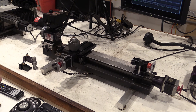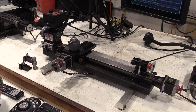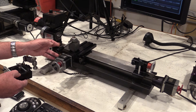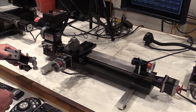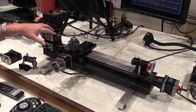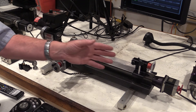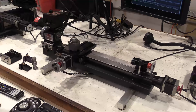Sherline makes what they call riser blocks, and here's one — it's an inch and a half. This comes off, the riser block goes on, then this mounts on top of it, giving you another inch and a half of radius, or three inches of diameter that you can cut. It also has the adjustments on it. Every part you need to raise everything up — tool posts, tailstock, all of it — is supplied as part of this package, so you can work the way Sherline originally intended or with their upgrade package to make it taller.